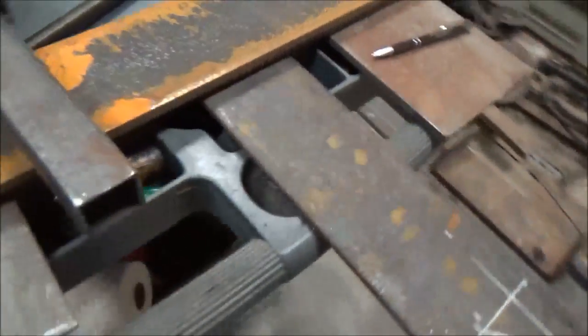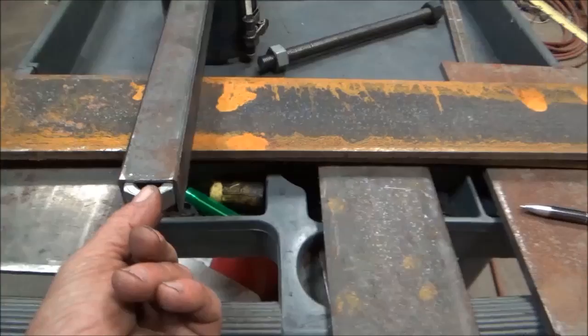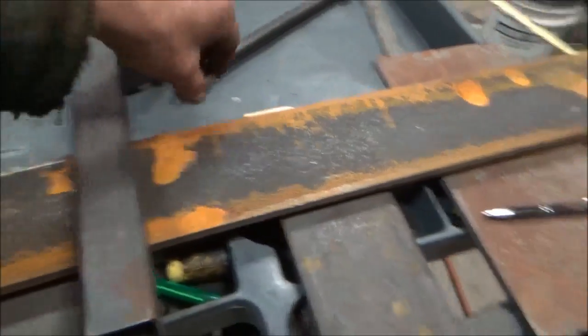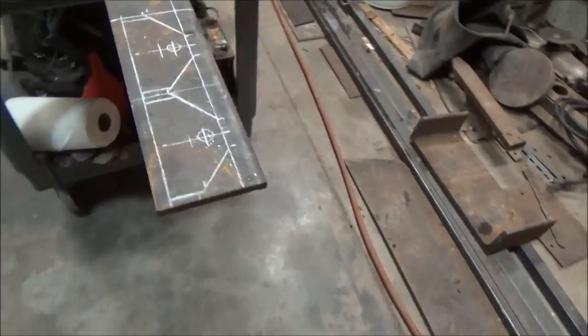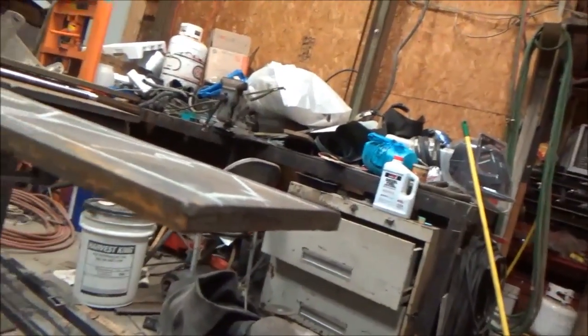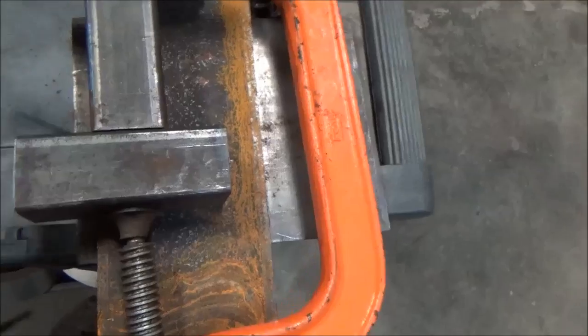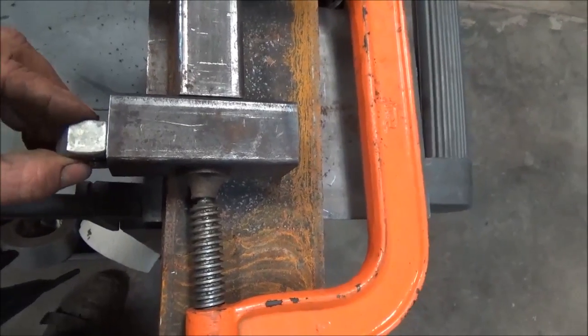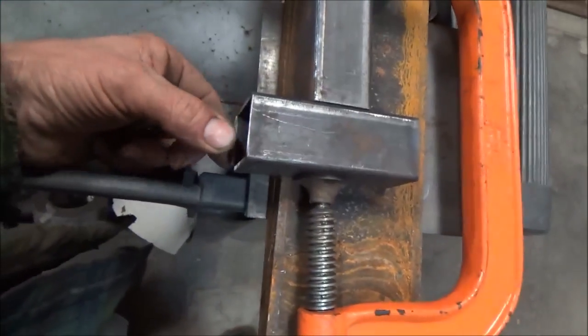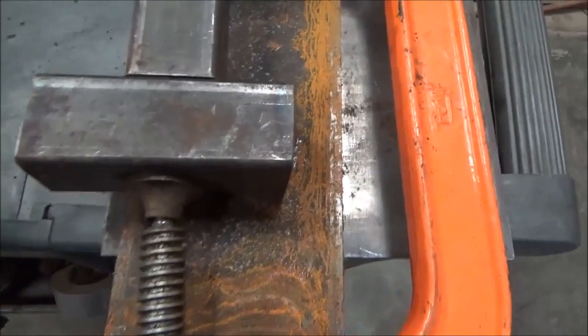Here's the square tubing and the nut, here's the threaded rod, here's an extra nut — it just fits in there, a nice snug fit. Some more scrap metal that I picked up on my job, pretty thick stuff, about three-eighths of an inch. We're going to use this chop saw down here to cut a couple pieces off of this. Cut my pieces out and made them both four inches long. This nut will go inside — have to clean the burrs off first, push it in there far enough to find the hole once the hole is in there, and then thread your rod into it.